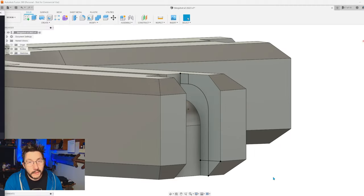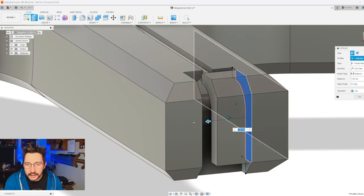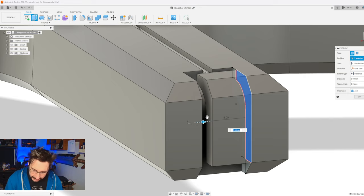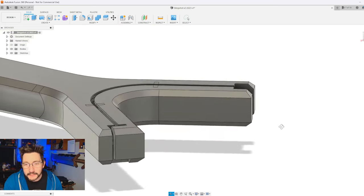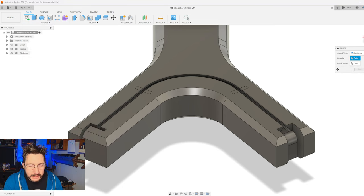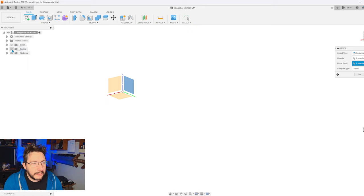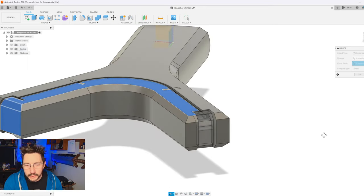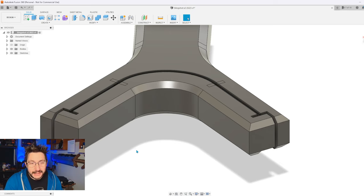Hit finish — only a few more steps to go, we're almost there. Now it's just an extrude and a mirror. Click here, hit E for extrude and start to bring it out. Nine seems too much, eight isn't enough, so 8.5 millimeters. That looks proper — that way the rubber band can tuck in. The only thing left is to mirror it to the other side because these sides should match. Create mirror, the object is this extrude, the mirror plane — turn off the body to click it, re-enable the body. The preview looks good. Hit OK. And you've done it — you've absolutely done it. This is the slingshot. It's got a logo, it's got a captive area for a rubber band. All we have to do now is print it.